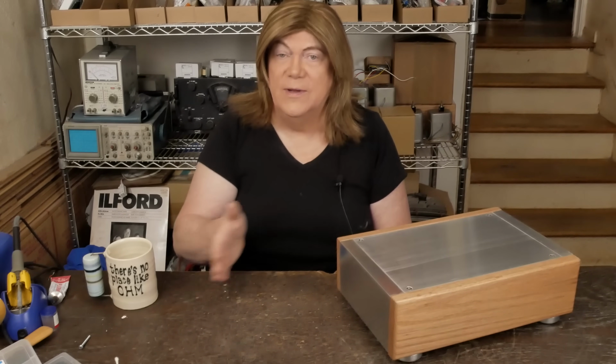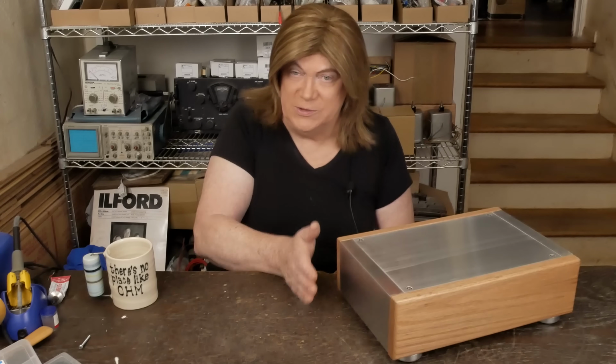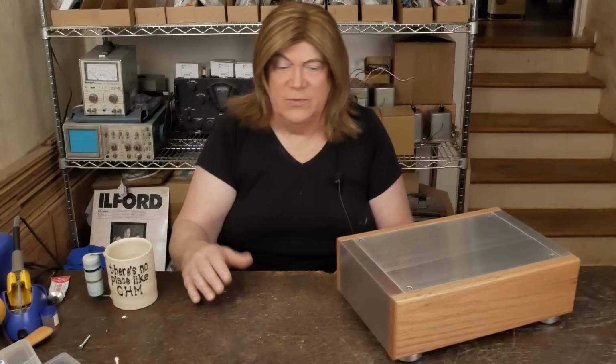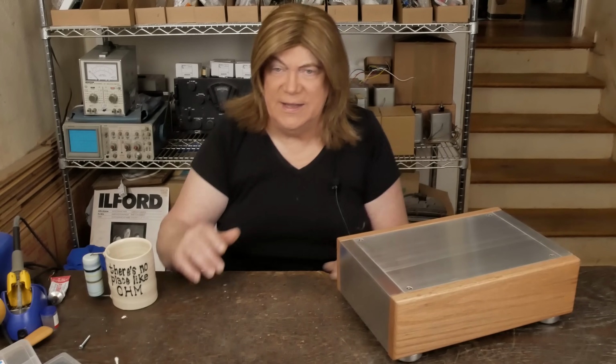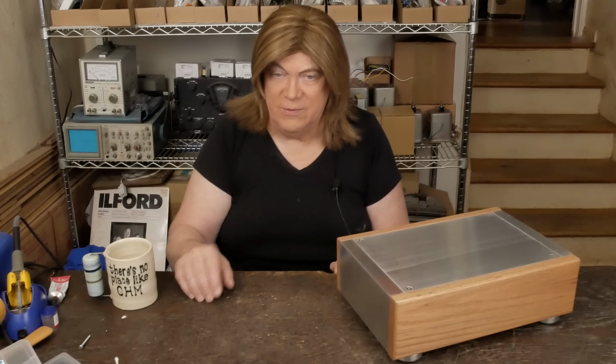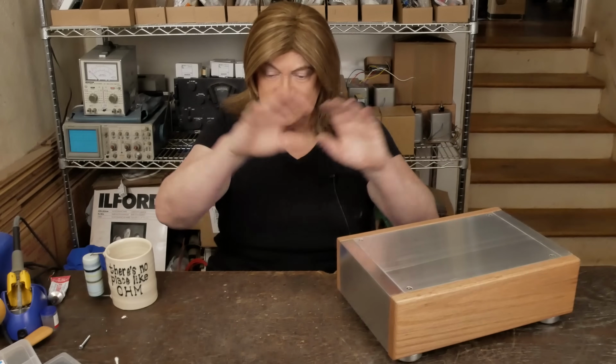So instead of doubling the cost going to monoblocks, it's going to be 120%. We do have to duplicate the rectifier tube. We're duplicating the chassis, duplicating the IEC connector. We're duplicating the choke, which he also said that he can make a 100 milliamp choke that I would need that would top mount. And the transformers would be a little smaller too. And then it starts making sense. And so I think that's what I'm going to do with these.